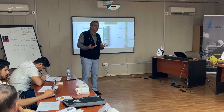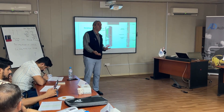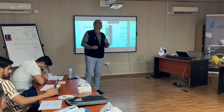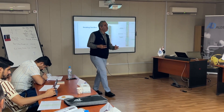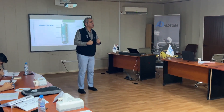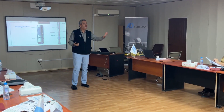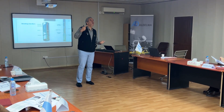We have two types of bearings. One is the mud-lubricated bearing and the seal bearing. The seal bearing is a closed system. There is a special oil we use for high-temperature drilling, or sometimes when we plan to stay in the hole for a long time. It can last longer than the mud-lubricated bearing.